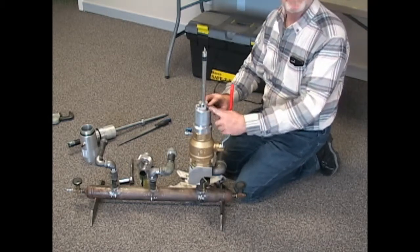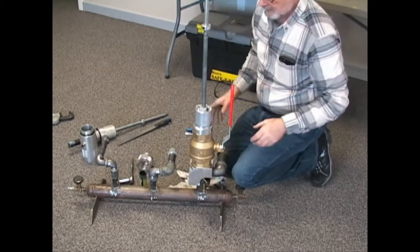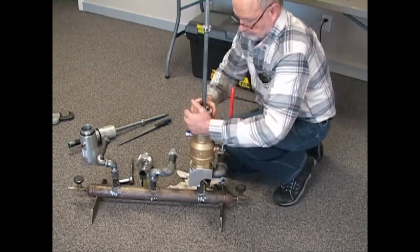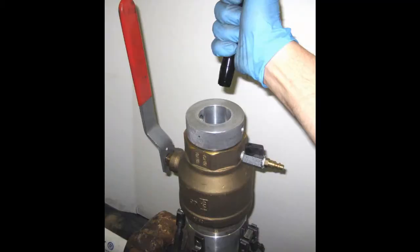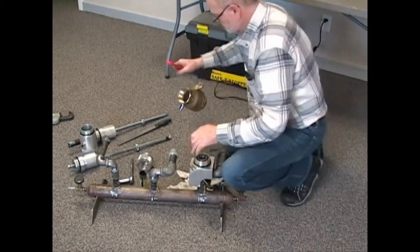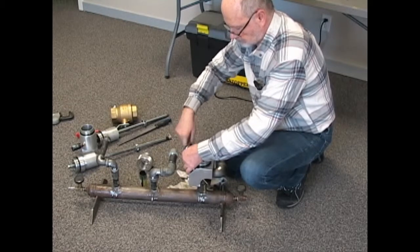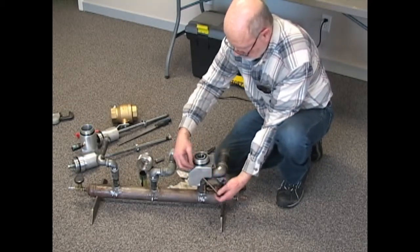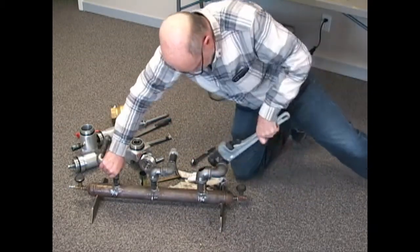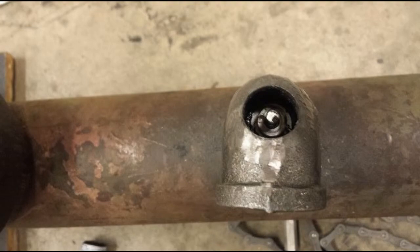Loosen the reference collar with the hex wrench. Push down slightly on the shaft and turn it clockwise until the plug disengages. Retract the shaft above the ball valve, close the ball valve, and bleed off the excess gas. Fit the viewport and open the ball valve to check that the expansion plug has been properly inserted into the elbow or nipple. Then remove the assembly. At this point, the female by male and female by female elbow service operation is complete, and abandonment operations can be carried out according to company procedures.